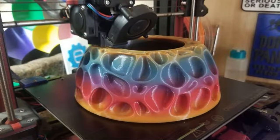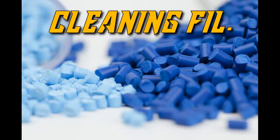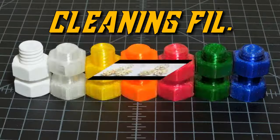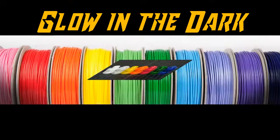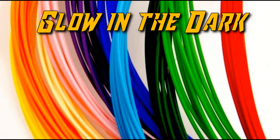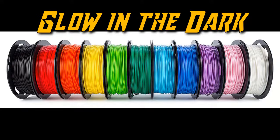The remaining filaments I will touch on briefly. There is cleaning filament — while not intended to actually print objects, it can be printed at similar temperatures to the previously used filament to clean out the hot end. There is also glow in the dark filament. Glow in the dark is notoriously some of the most abrasive filament out there, and using it regularly will cause you to change your nozzle out regularly. Other than that, it's a pretty cool thing to play with, and you can get it in different glowing colors such as pink, green, yellow, and blue.